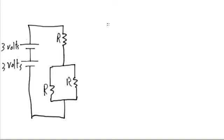Hi, Paul. I think this is roughly the circuit that you were talking about. You had probably just one seat of EMF here, where I've got two of them. But I got it that way for a reason. I want to actually start off with a slightly different circuit. I'm going to connect a piece of wire from there to there, and then I'll remove that to get to yours. So in this circuit, we've got three conductors connected together by circuit elements.